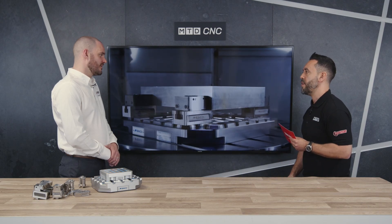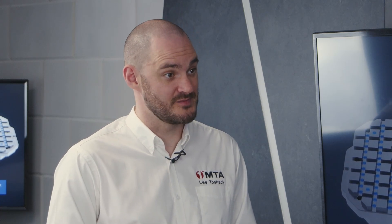What does top tooling mean and how do you use it within the system? Conventionally you'd have your five-axis vice, centric vice, or standard machine vice on your table. Using the pallet system you can be running production runs, but if a rush job comes in and you need to strip the machine down, you simply remove the pallet, build your workholding straight onto the base plate — there are fixturing holes on top as well as within the zero points — machine your rush job, then take that off and put your production run back on without ever disrupting your setup. It's very customizable.